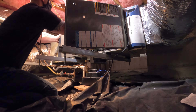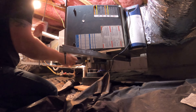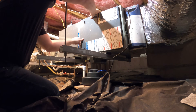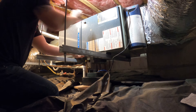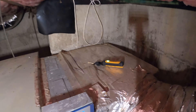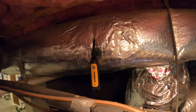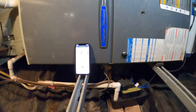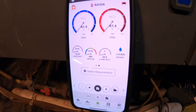So I'm going to get an accurate reading of the return. This is where the Field Piece wireless psychrometers really come in handy. All you need to do is drill a 3/8-inch hole into the duct and they work great. I prefer to use the MeasureQuick app on the iPhone. And there you go — 45 degrees, looking good.